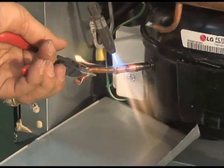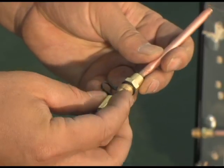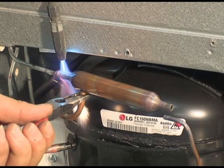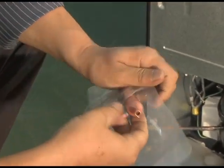Eliminate the sealing pipe using the oxygen welding machine. Weld the nipple pipe, welding after separating the needle valve inside the nipple to prevent damage from welding heat. Exchange a new dryer after removing the existing dryer. Vacuum packaging must be used for the dryer.